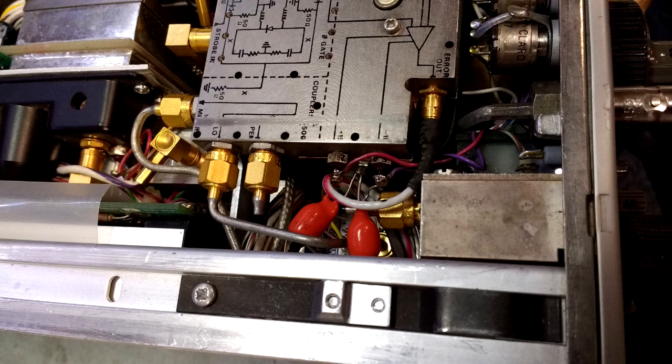You could locate suspect caps on the schematics, but tantalum caps are fairly easy to identify, so a purely visual approach may be faster. Most tantalums are of the dip type and look like small balloons. Some are axial like aluminum electrolytics. Most of the failing caps we found on this and other instruments are of the dip type.